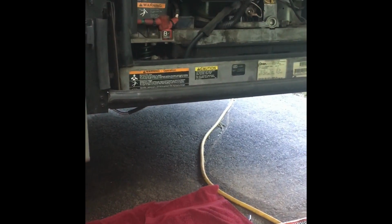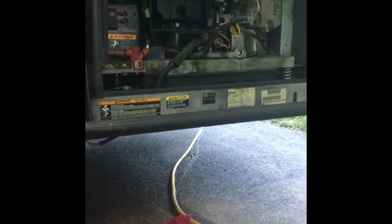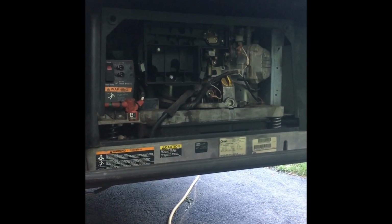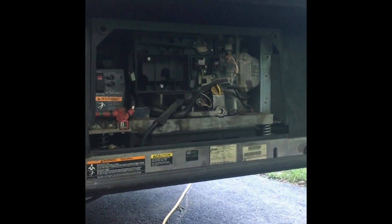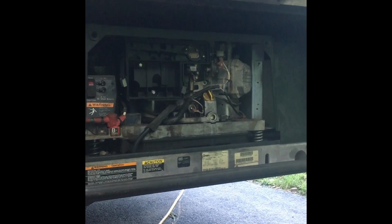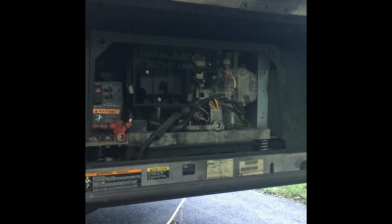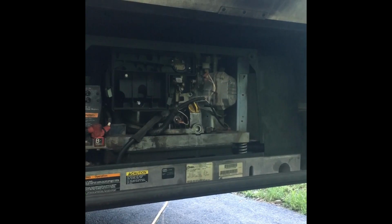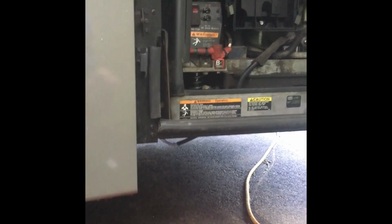And I think I kind of proved this because on the last trip I decided to be smart and not run the generator until the last hour of the trip. I started it 7 hours into an 8-hour trip, thinking it would run for 2 hours before it overheats. And it shut down 10 minutes later. Now the generator was cold, but of course the underside of the RV had heated up, and that is where the fuel pump is underneath.